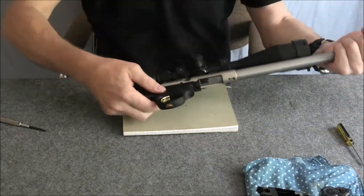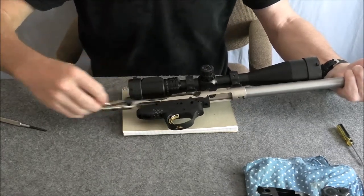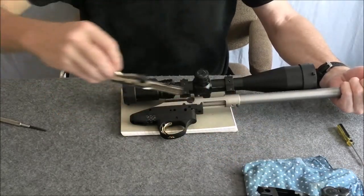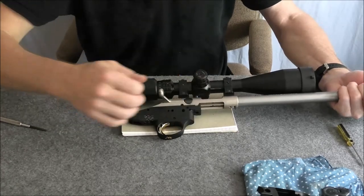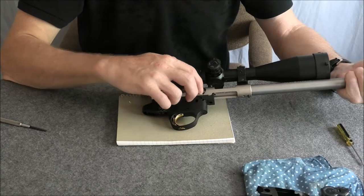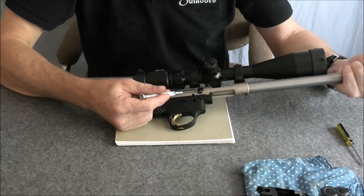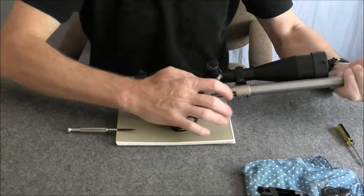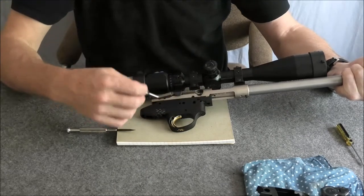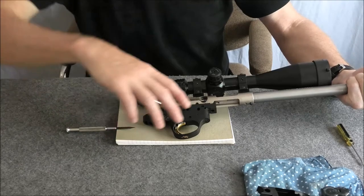The bolt's back in. So what I've also done is on this round portion — I was getting a big burr right there that was developing when the bolt pops back in and when you yank it out. It should be rounded so I've rounded it a bit, taking the burr off and taken off a few other sharp edges that shouldn't exist on a quality rifle.